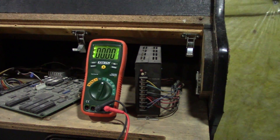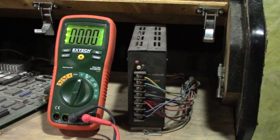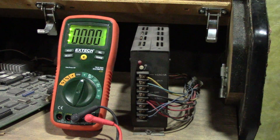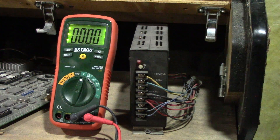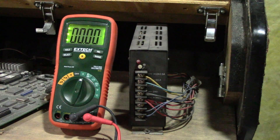I was just going to test the voltages, so I figured I'd do a little video on it. This is just a standard power supply that you're going to see in a lot of games. Let's turn it on, because you want to make sure that the voltages are accurate going to the board and within range.